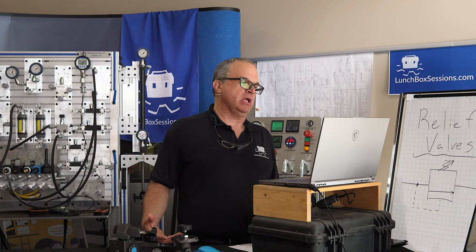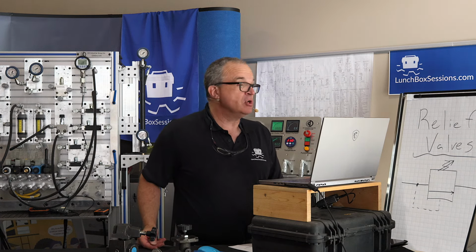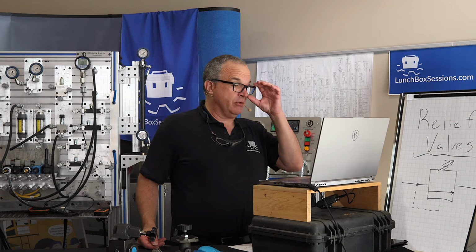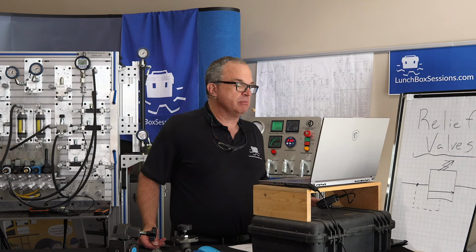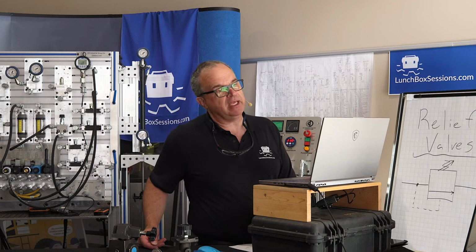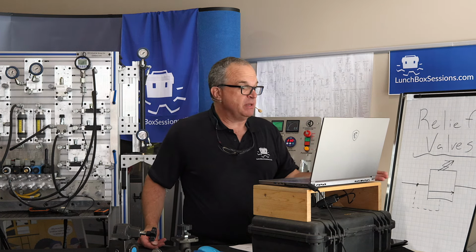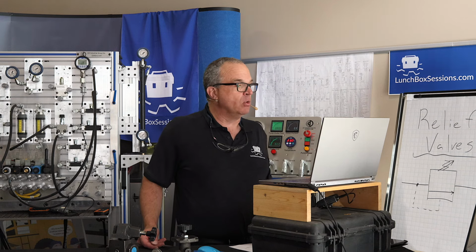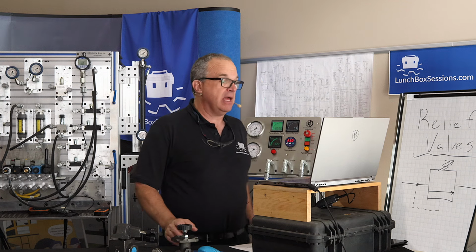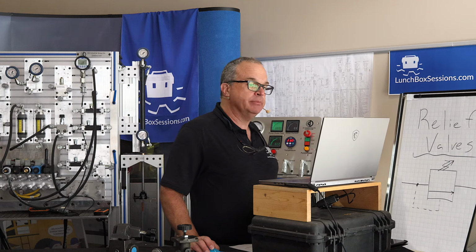But the vast majority of hydraulic pressure controls will increase their pressure as you turn the control knob clockwise. There is a really notable exception in the world of the counterbalance valve. Not today's topic. It's sometimes exactly the opposite. But best to be sure by reading manufacturer specifications or find someone who knows that machine really well. Or, if it's a piece of mobile equipment, quite often the manual will be very specific, talking about turning something clockwise to increase the pressure. And yeah, very good question. You want to be sure you're safe before making an adjustment and doing it correctly.